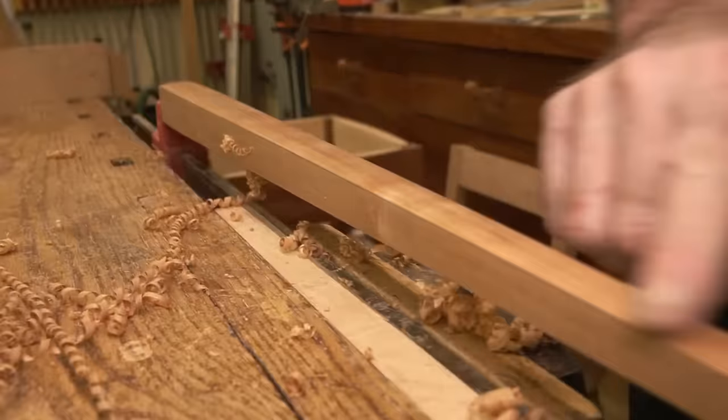That's why I'm going to move next to filing. And in a way, these steps are going through a sanding process. We're going from a coarse kind of abrasive to a finer file, all the while refining and shaping and truing up. But it's a fast process between each stage. So this stage, I'm using the coarse one now, I'll go to the finer.